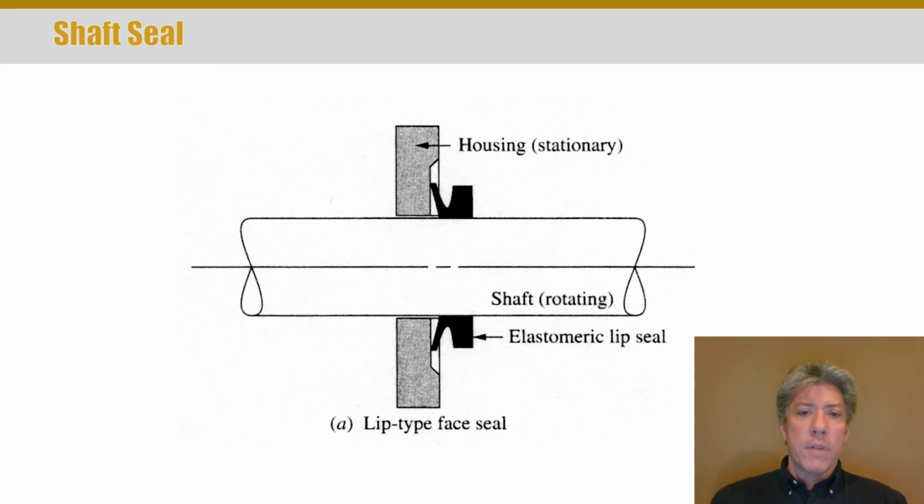So one of the difficulties is, even in installing a seal, you can damage it. You've got to have the right material. Another huge thing is that the seal has to be compatible with the local environment, whatever it happens to encounter in terms of temperature, dirt, wear, abrasion, whatever, vibration, and it has to be compatible with the chemical makeup of the oil. Oil is not a simple thing where we just pull it out of the ground and throw it in the engine anymore. There are tons of additives, there's synthetic oil, there's different things included in oil, and if you don't get the right sealing material with whatever it is you're trying to seal against, the seal is going to degrade very quickly, because it's a very stressful environment, I should say, to the material.